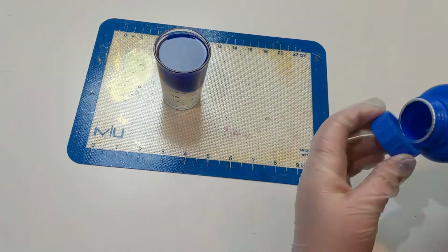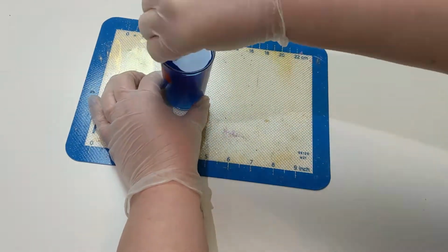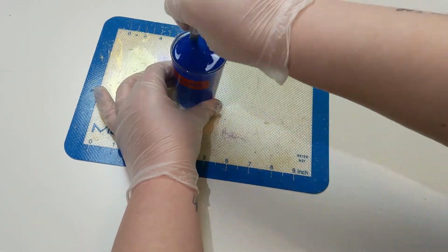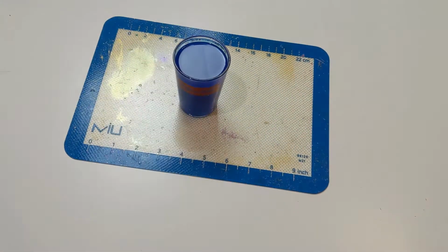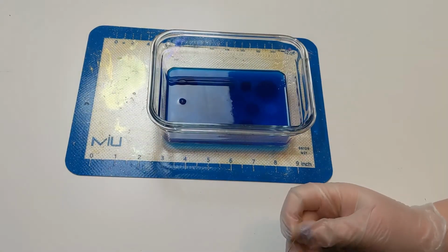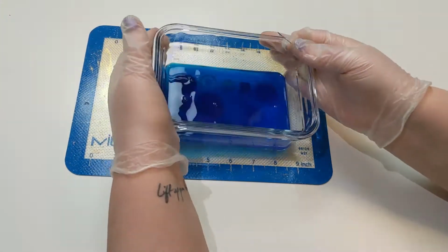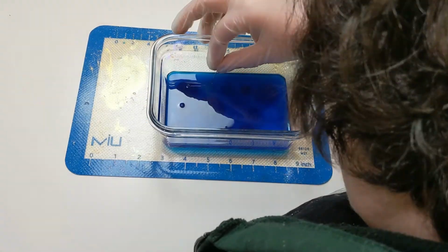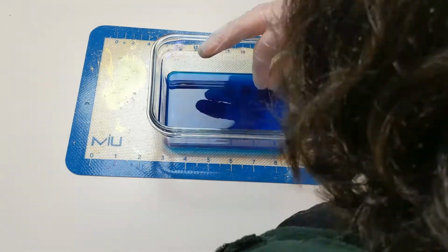I got this molding silicone off of Amazon. I'll link it in the description below. It's just sort of some random off-brand molding silicone. Mix it 2 parts, pour it in, and then I babysit my mold for a while and try and get all of the air bubbles I possibly can out of those little buttonholes with a pin.